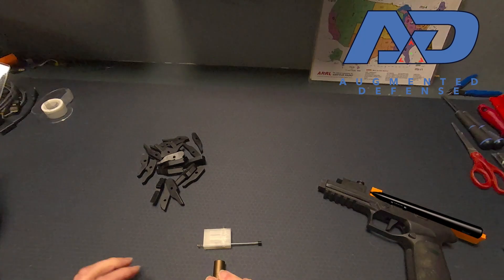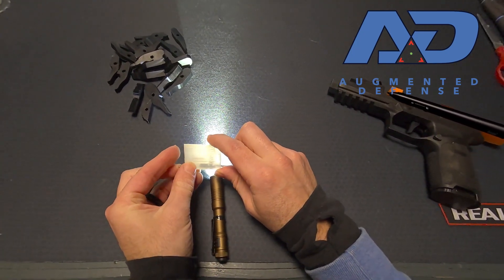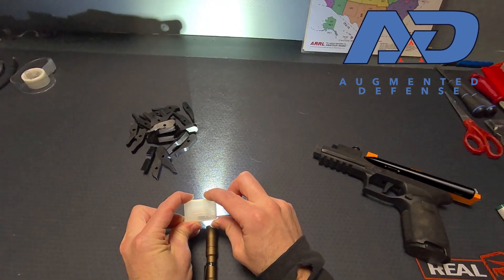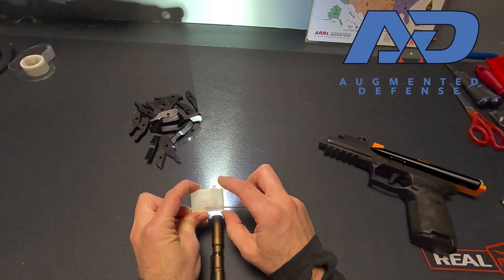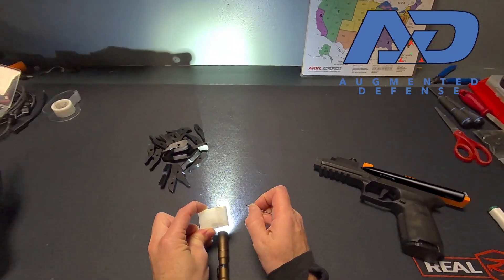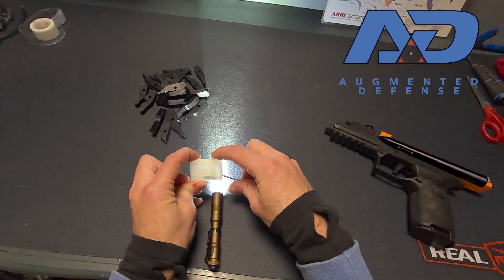I'll show you inside the trigger module now. You can see inside here there is a 5mm ball bearing on a shelf. You've got adjustable tension on both of these, and I've got a large set screw so I can adjust while testing easier without needing an Allen wrench. The first setup I did — which I'm no longer doing — had a flat 2mm steel rod coming up against that ball bearing. The problem was the sharp edge, even though it gave a crisp break, would mar the ball bearing over time, causing the trigger to seize up and behave badly.